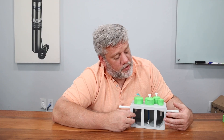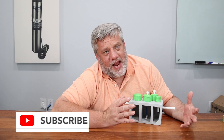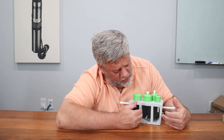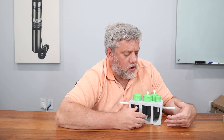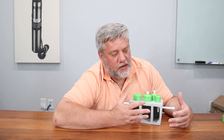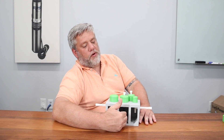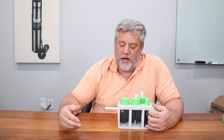This is an EnviroFlow system. The EnviroFlow is set up similar to other systems. If you really dive into septic systems in general and look at them from a CAD drawing standpoint or a cutaway, they're very similar. There might be some nuances as far as size, the amount of aeration, how big the trash tanks are, how big the pump tanks are, but in principle and design they are very, very similar. On this system you have a trash tank, an aeration chamber, a wall, and then what's called the clarification chamber.